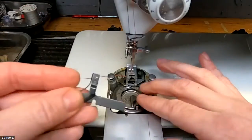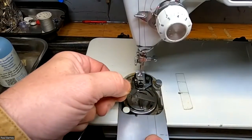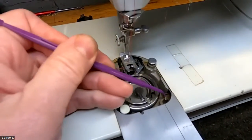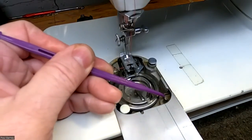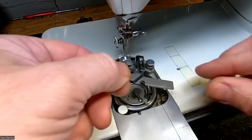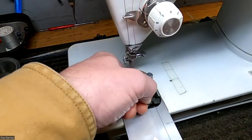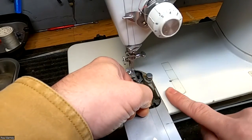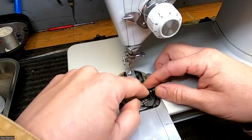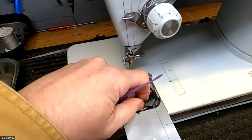With the bracket, you're going to come in at an angle. You'll see kind of this little track right down in here — this part of the bracket kind of rides in that track. You're going to come in at an angle and feel it have a little bit of resistance. There's a spring underneath here, so make sure you get underneath that. Then you're going to slide it over until it gets on the other side of this eccentric screw here and drop it down into place.